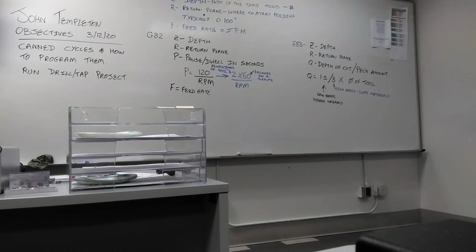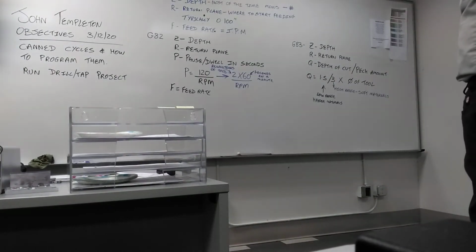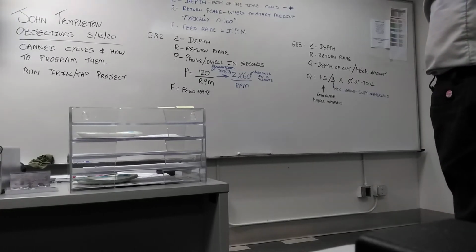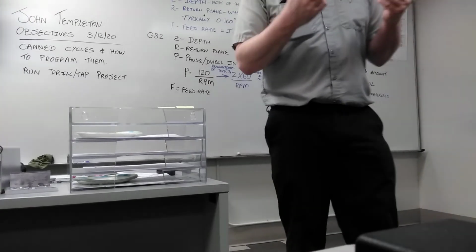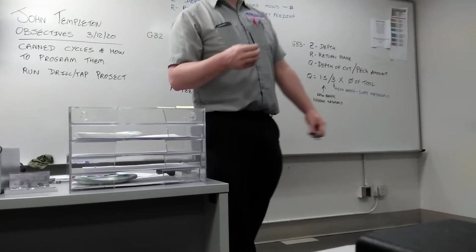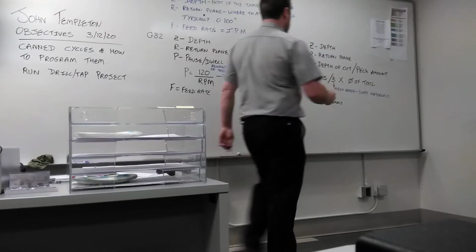What else is going to be a factor? How thick the material is? How does that affect anything? Because if you have 6 or 8 inches to cut, it's going to be more. Bigger diameter, which tool is stronger? The thicker one. Why? It's more rigid. This one is a lot easier to flex if you go too fast. So depending on the diameter of the tool, it's also going to depend what range you are going to work with. So that low range is for smaller tools.